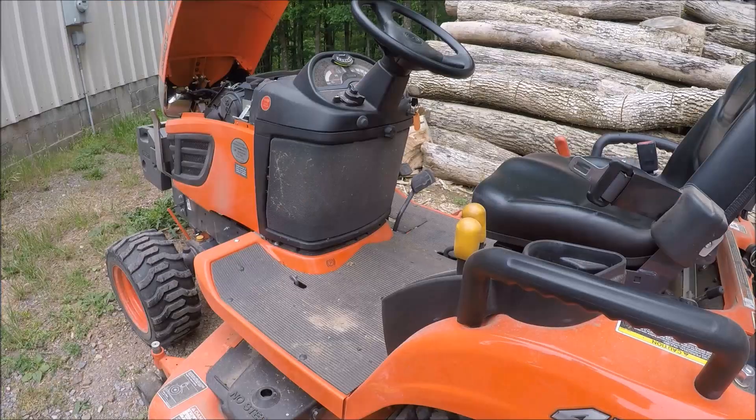Back under the hood, I like to remove my air filter since I'm working in dusty conditions and blow it out every week. You can check yours to get a feel for how often you need to blow it out — you might be able to get by two or three weeks where you live. It's going to vary depending on how much mowing you do. You'll want to regulate your air down to 30 psi to blow the air filter out; if you're using too much pressure, you can actually blow the pleats apart. This air filter is blown out weekly — it's just very dusty conditions.